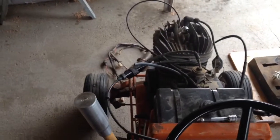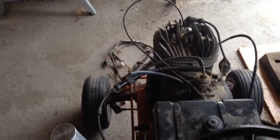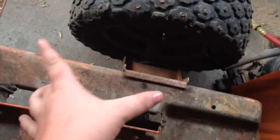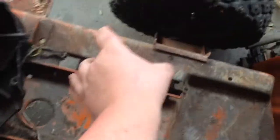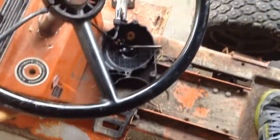Because I mean, there's play in this thing, not turning. Right after that it'll start turning, but that's a lot of play to be messing with, especially when you're going that fast. Yeah, pillow block bearing over here to sprocket, have a jack shaft go across, have another sprocket, bigger sprocket on this side, smaller one on this side, so it gears it down, and run another chain down to the sprocket down there. And that's pretty much the idea.